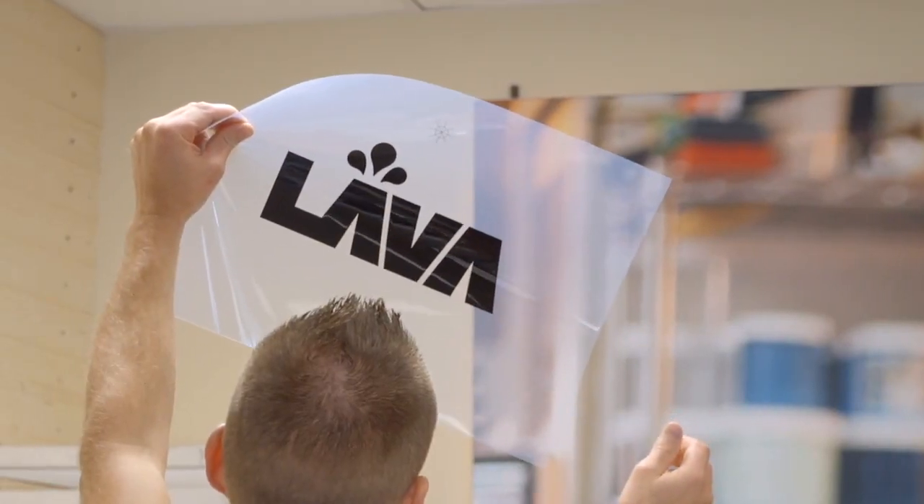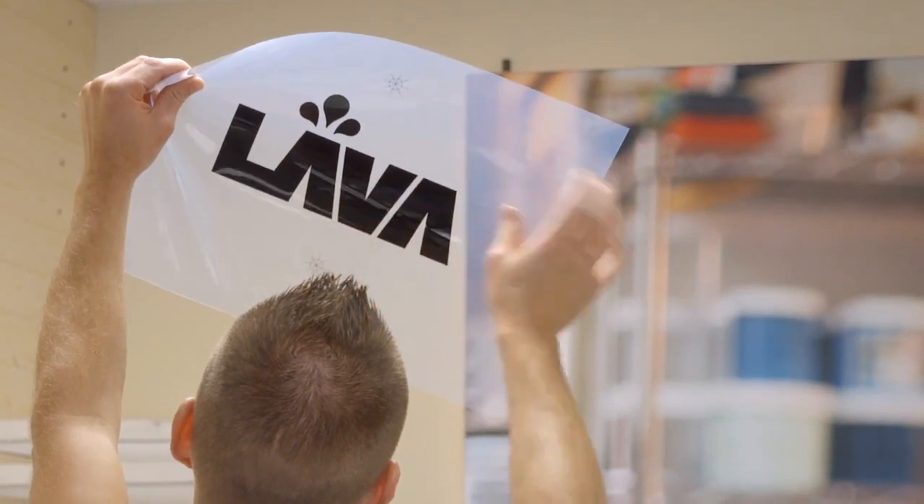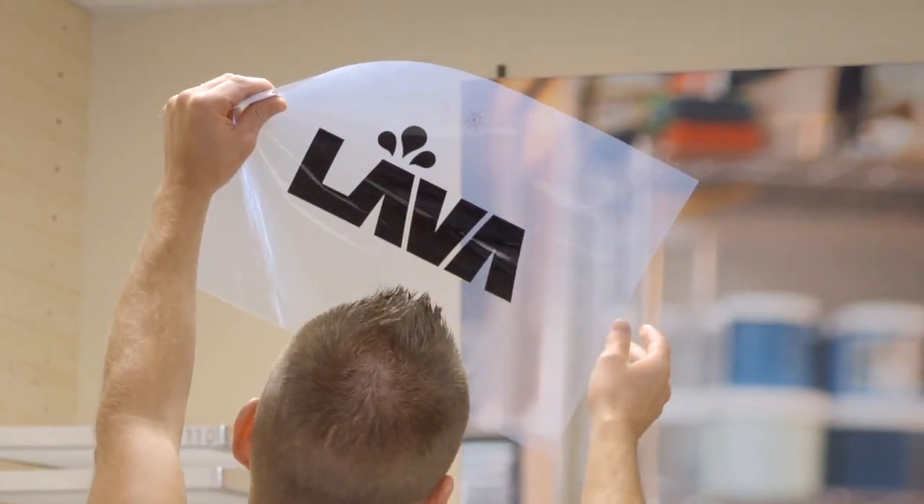The goal of your positive is to block out 100% of the UV light during the exposure. This means your film positive image area should be black, and if you hold it up to light you should not see any light coming through it.